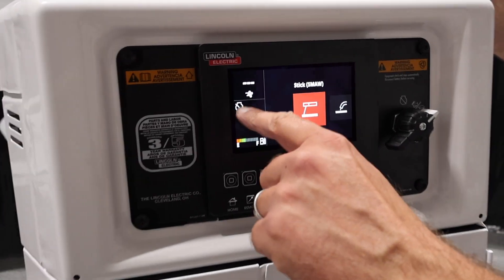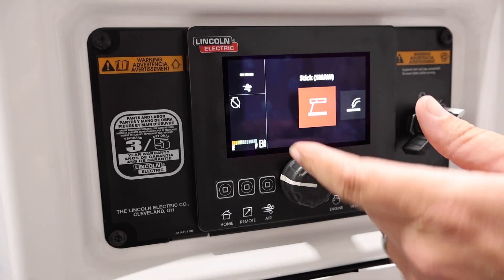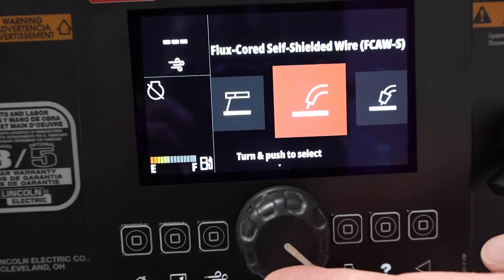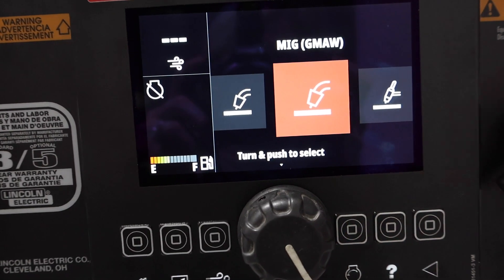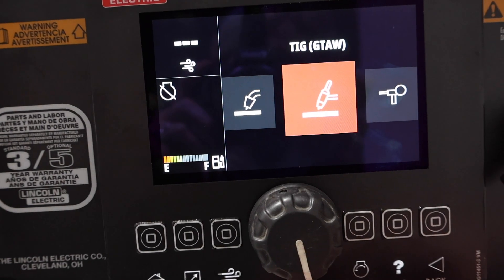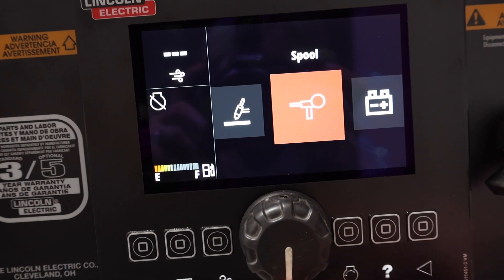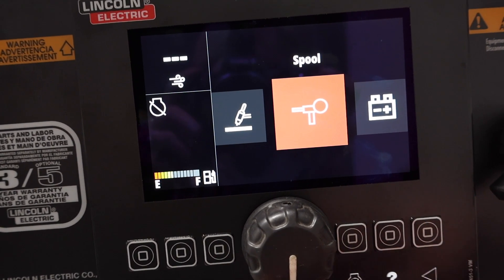So we've got our fuel gauge. Engine's not running. We've got our air — so when we fire up the air, we're going to get a PSI rating on that. On this unit, we can stick-weld with it, toggle over to flux-core self-shielded wire, flux-core gas-shielded wire, and we can also MIG weld with this — all going to be with a suitcase LN-25 feeder off the front. We can TIG weld with it as well, DC electrode negative only. And it has a direct-connect spool gun that you can buy with this — it plugs right into this unit with no extra components.